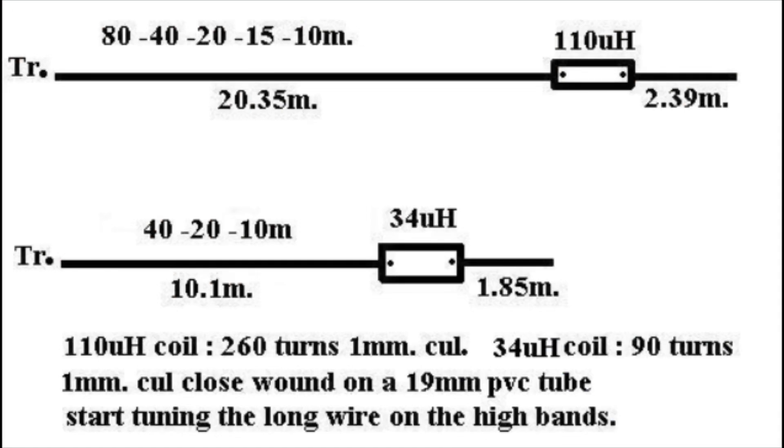Looking at the antenna itself and how it's laid out — we're looking at the bottom one, by the way, not the top one. It looks familiar. We've got just over 10 metres of wire going up to the coil, which gives you basically a half wave on 20 metres and also a full wave on 10, and should give you a very good SWR match for those two bands. The coil itself is 34 micro-Henrys. You can see in the description how to make that coil yourself. After that, you've got 1.85 metres of wire. So overall, the antenna is just about 12 metres long, and that can be used with any commercially bought 12 metre fibreglass pole like the Spider Beam pole. You can use that as a vertical — a pretty easy to deploy antenna both at home and portable, that doesn't require any sort of ground radial setup at all, and therefore very little space.